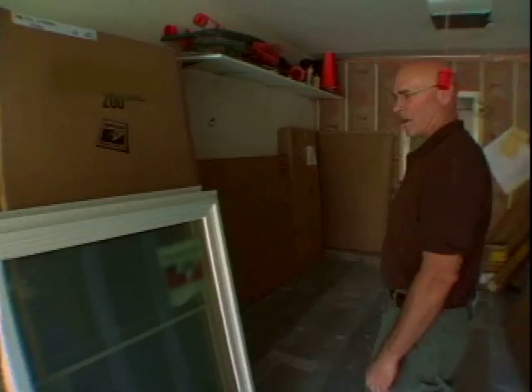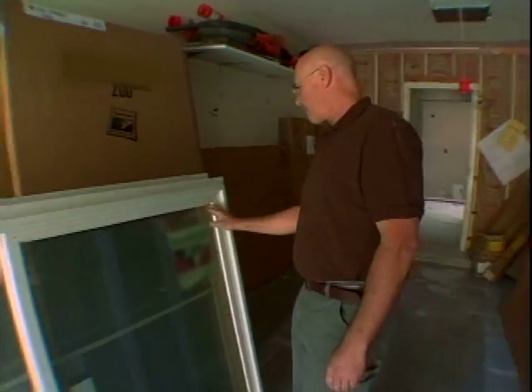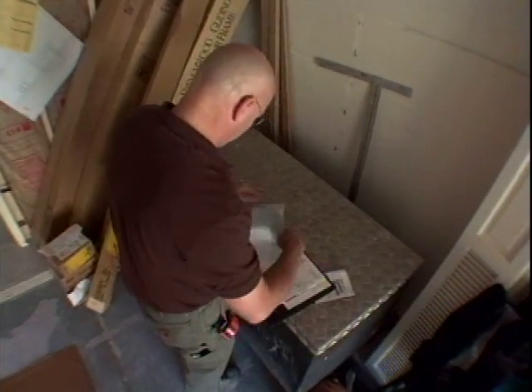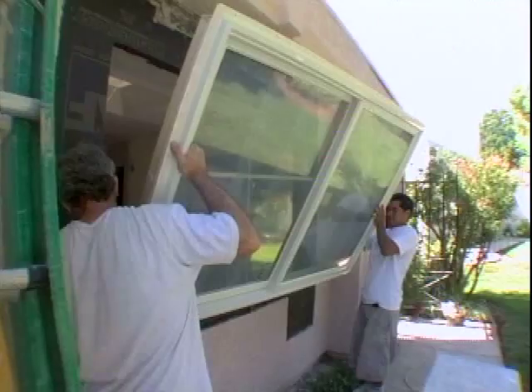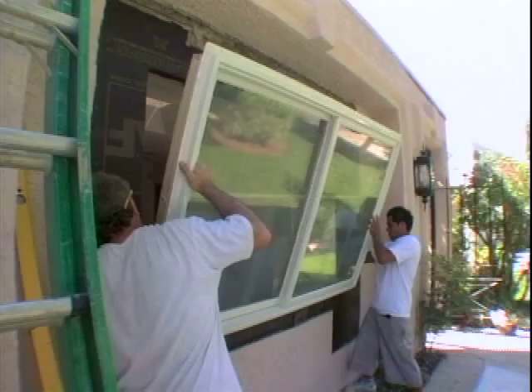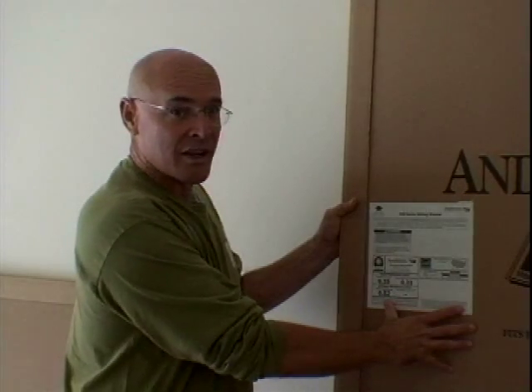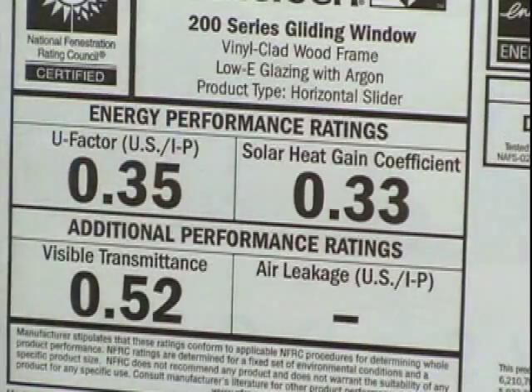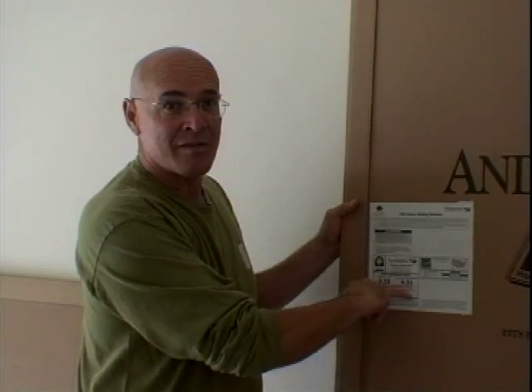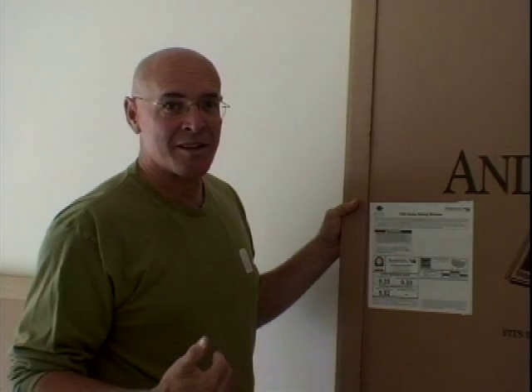We can probably put a couple of these in today. I spent more than I wanted to on doors and windows, but I wanted to go with really high-quality ones because that's an important part of the whole passive solar design of the home. All the doors and windows are dual glazed, but some have different films inside that block the heat. This door will go on the west side and has a number of 33 — it only lets in 33% of the heat. The ones on the south are going to have a higher number, 65 or 70, because we want that heat to come in.